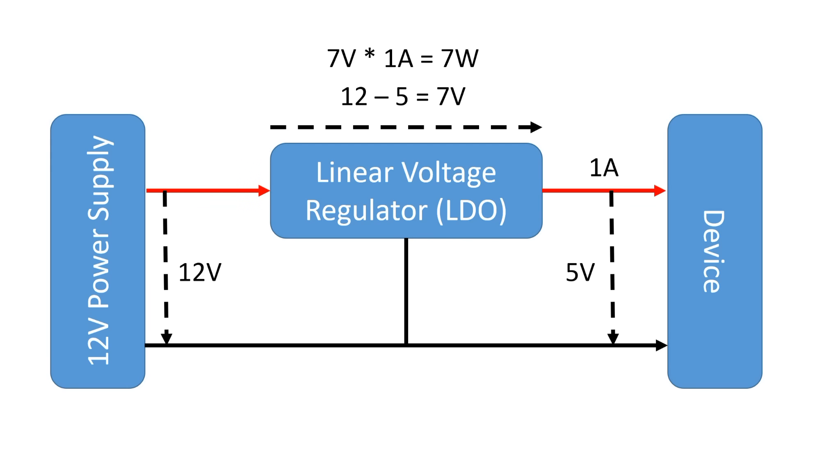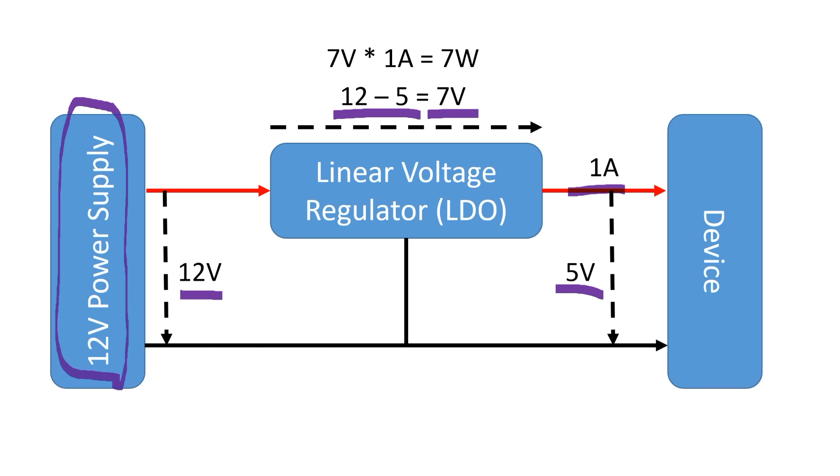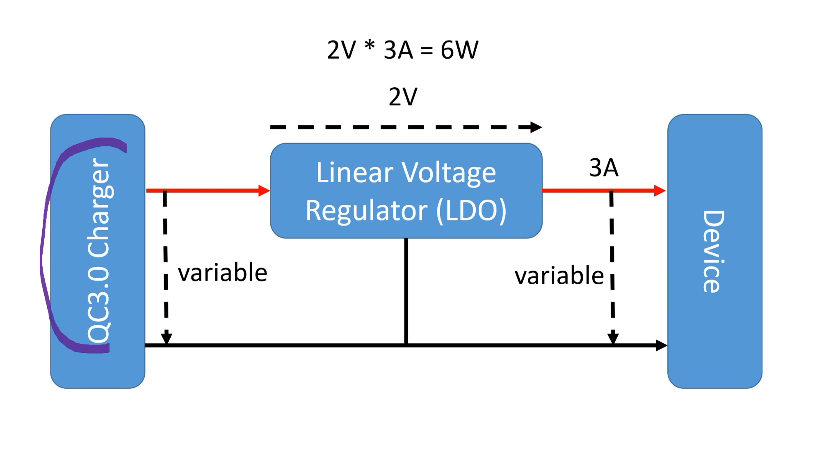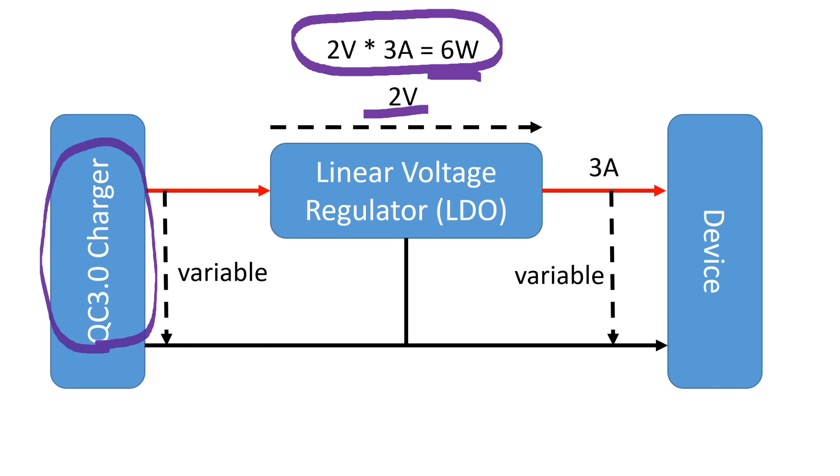Such a device should also be able to deliver small voltages and be more accurate. This is why I added a variable linear regulator — only a small one from my lab, so it is a proof of concept, but sufficient to show the point. For a power supply with maximum 10V, we usually would use a 12V fixed power supply. What happens if we draw 1A at 5V? The voltage regulator has to destroy 7W, which heats it up and requires a decent heatsink. If we go to 3A and 1.5V, it would have to destroy 31.5W, needing a huge heatsink — and even then it might be impossible because the linear regulator package might not be able to transfer the heat from the junction to the heatsink. What about if we use our QC 3.0 power supply? If I adjust the voltage level to about 2V above the output voltage to give the regulator enough headroom, we always get a maximum of 6W — much less — meaning we can use a smaller heatsink and also a smaller power supply.